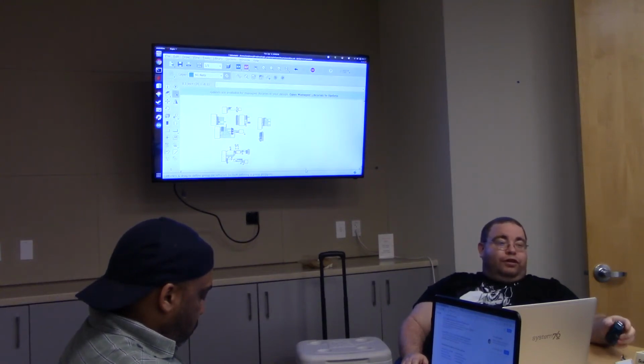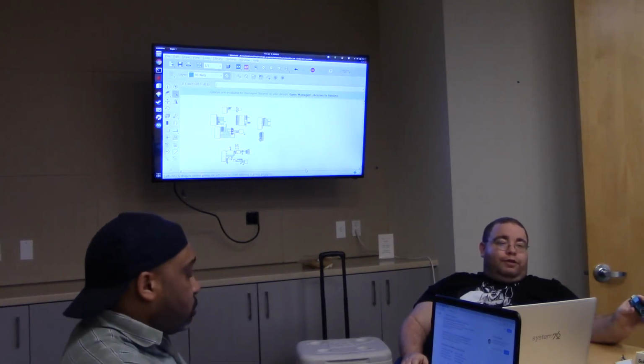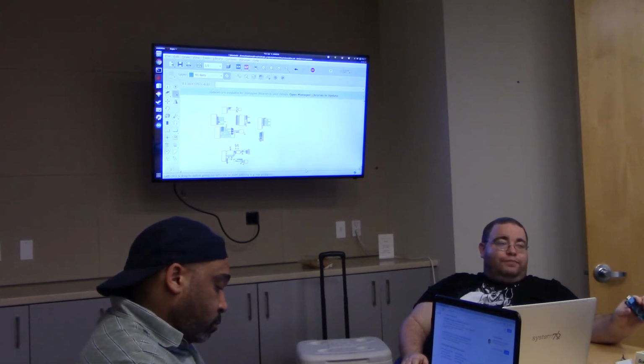You got 6 bits each for red, green, and blue. But forget that for a minute. I've got 9 bits per pixel. I want to be able to store a pixel in 8 bits. Someone's got to give.